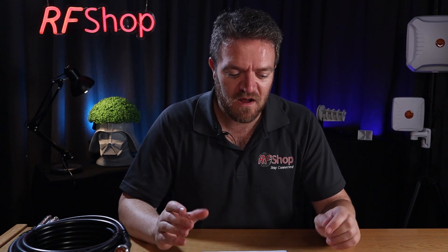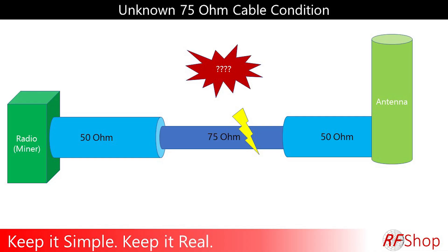It's better to just go for a new, decent cable from a good supplier — if you're anywhere in the world, just use a nice low-loss 50 ohm cable, and a fresh one. Using old cable in general is not my favorite either, because the cable comes out at the wall socket and at the roof — but what happened in between over the years, you don't know the history of the cable. We do have cable testers so it's theoretically possible to check, but that's not something you do every day. So to summarize: it's a big impedance mismatch — that's the main reason not to use existing TV cables for a helium setup.